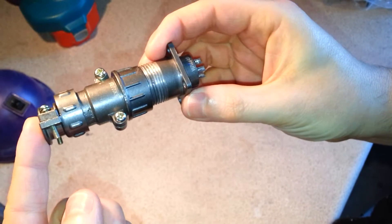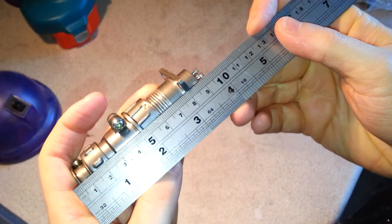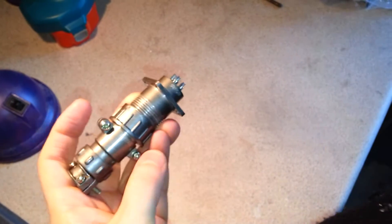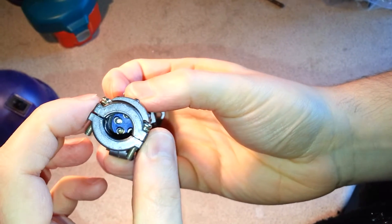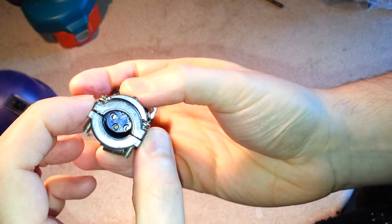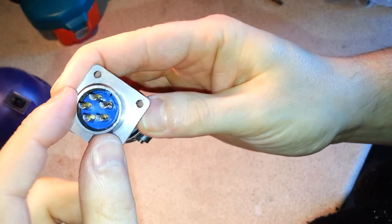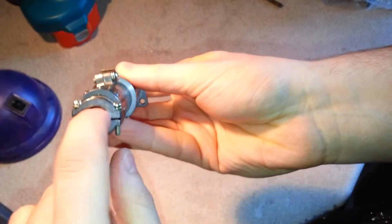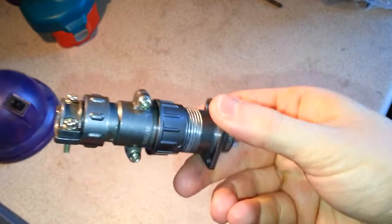Now I originally bought this for the VFD, but as you can see, it's quite a lump of connector. It is about 10cm end to end, 3.5 inches. It's just a right lump out at the end, and to be honest, that cable connector is a bit big for the sort of cable I'm going to be using — the spindle probably requires 1.5mm cable. That looks like it would easily do 2.5mm, maybe even 4mm cable, despite the fact that these are 2.5mm pins. It's a whacking great connector — you'd maybe even end up with something like armoured cable in there, but I suppose it is a military connector, so maybe they use armoured.